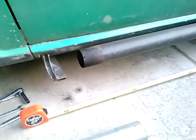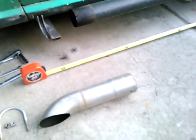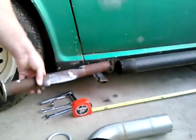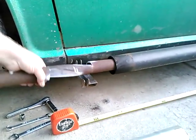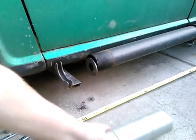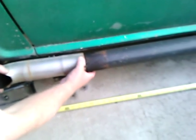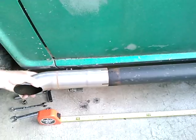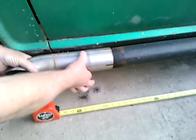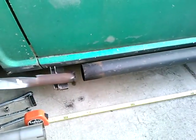Before I close, I'll show how these fit. Every one of these has a small washer and a big washer. The small washer will slide inside the pipe, but the big washer cannot. And when I put the outlet on, it's trapped — it doesn't travel down because the big washer is stopped where the diameter changes. So I can pretty rapidly take that off and try different configurations.